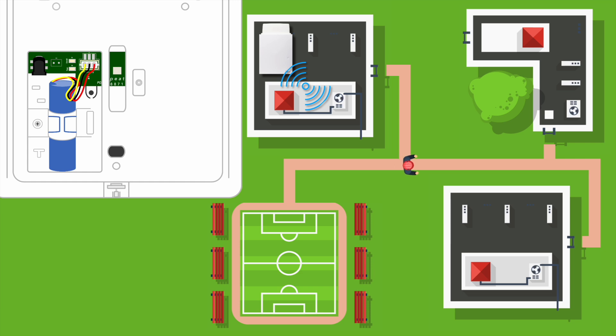Now that you've arrived again at the farthest building, retest with the repeater by pressing the Test LED button. All good now — you know the repeater has great communication back to the IQ Pro. Therefore, any device in that building, providing a proper LED test for each device, will be able to talk to the repeater or talk to the transceiver in the IQ Pro. Thank you for watching IQ Pro Best Practices. This concludes the second module in this series. Please proceed to the next video entitled Connecting IQ Pro Using IQ Installer Application.